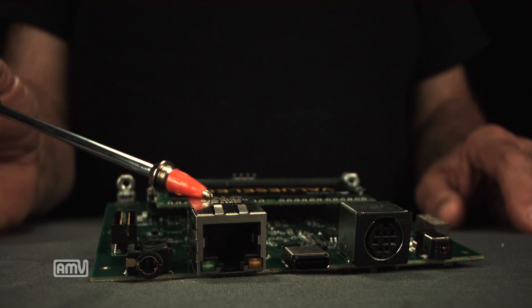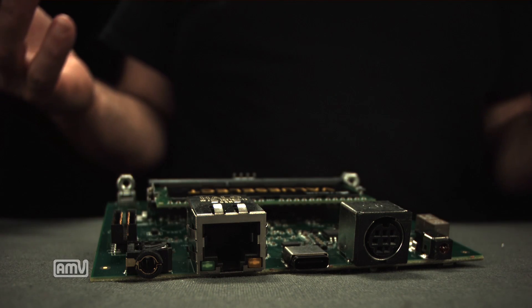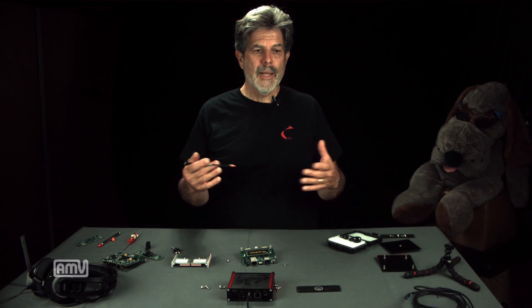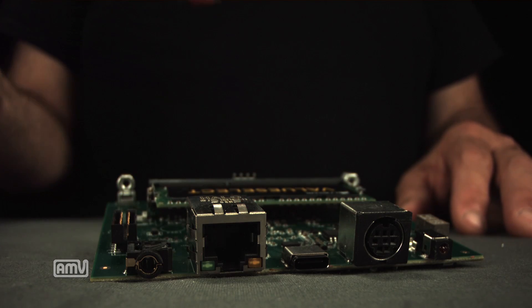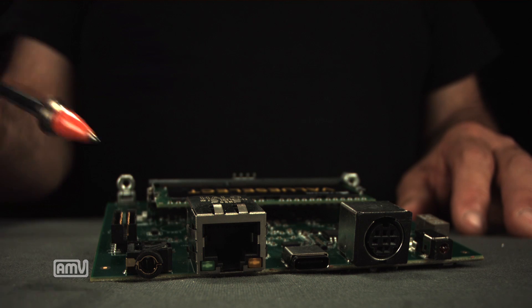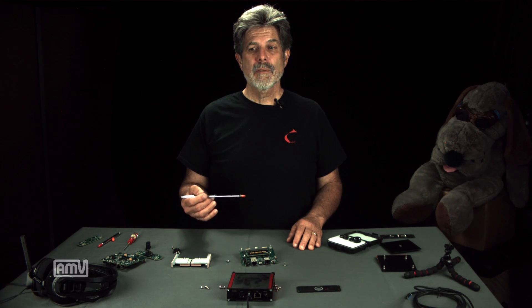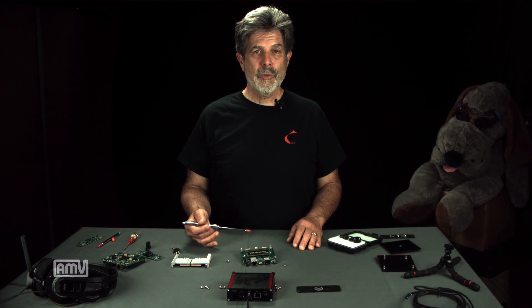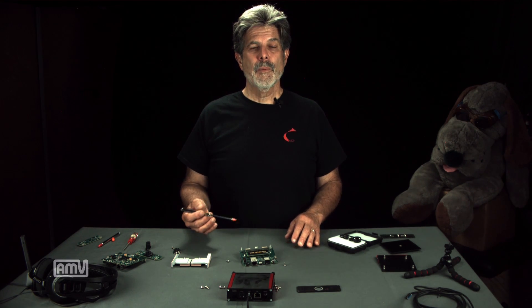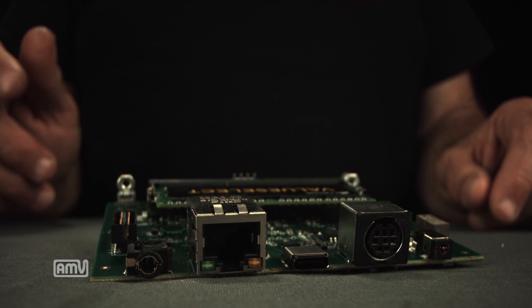Your typical RJ45 GigE connector. And the last one — the auxiliary audio port. When we talked to Twitch streamers and asked what they want, they said they want to be able to plug a headset directly into the camera. So we made this device look like a stereo output from the host. We take the mono input from the boom mic and split it equally into two channels. Those two channels are then interlaced with the video stream like the onboard audio is, and we give you controls onboard to pick which channel and control the individual gains on those audio channels.